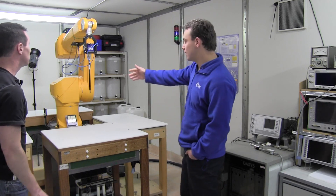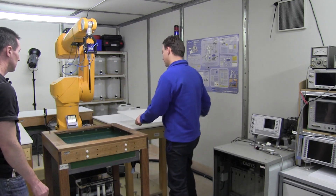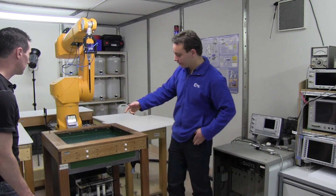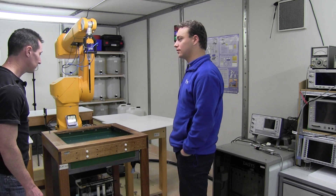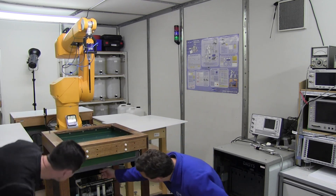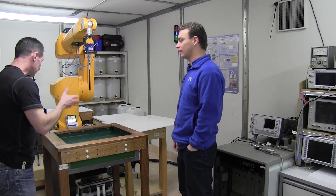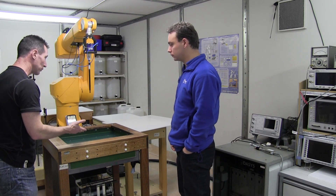Mobile phones is the big one — that's what everyone cares about. This is an E-field probe. Essentially, we dip this probe in this liquid here. The liquid's got similar dielectric parameters to human tissue. So we dip the probe in there, we put the phone underneath, and we measure the field inside the liquid. So that's just water with a bit of sugar and salt, and that's actually similar to brain tissue, apparently. That's right.